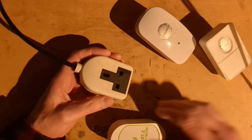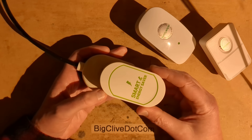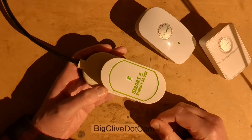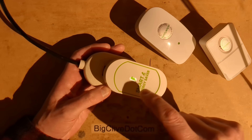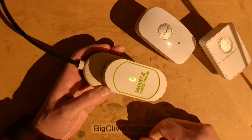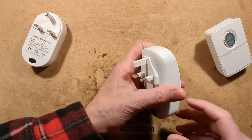And finally we have the Smart Energy Saver — a different style — and it has gone all in on LEDs. It's got a flashing LED with very poor regulation. When it lights, it's probably just a standard flashing LED; it lights up very brightly and then dims as it discharges the capacitor. Watch your eyes — the light is coming back.